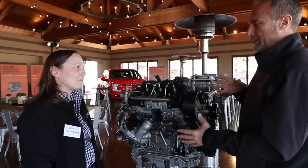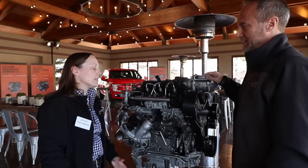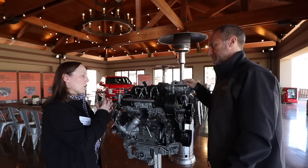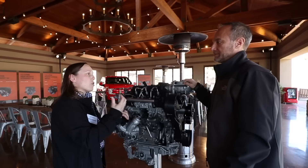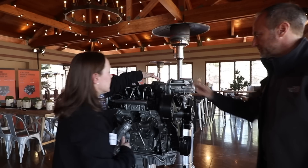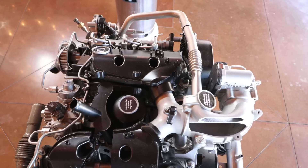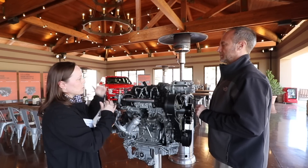To get into the F-150, we had to think about air induction. Air is pulled from the air box, comes to the turbocharger, gets compressed. That compressed air goes forward to the charge air cooler so we can cool it off, and then the cooled charge air comes back into the engine from the front left. You'll see we have this intake manifold with a nice gradual turn to allow smooth entry from the charge air cooler. You don't want very quick, fast turns — that builds up your induction losses, so the nice gentle turn is good.